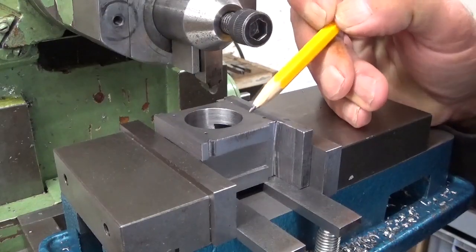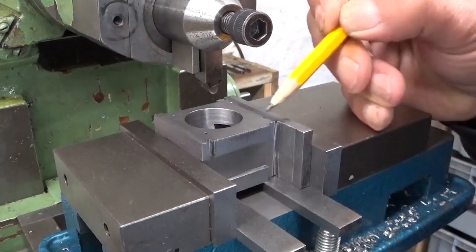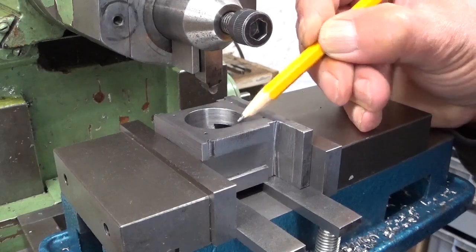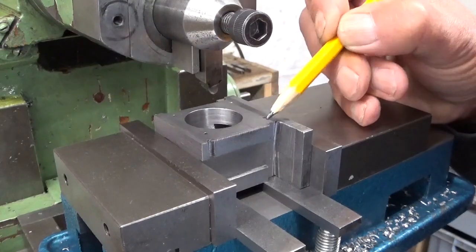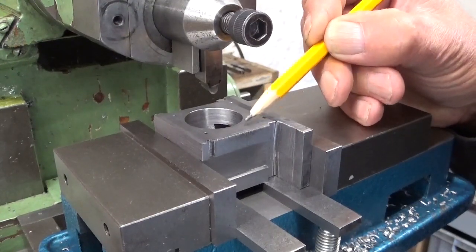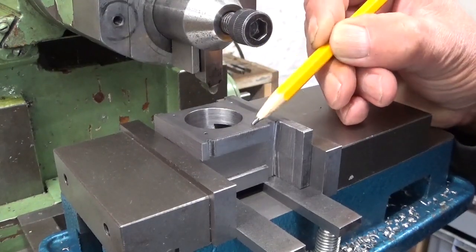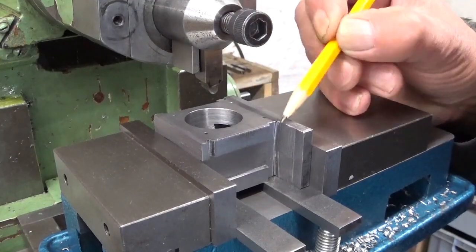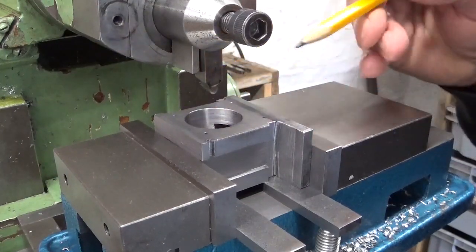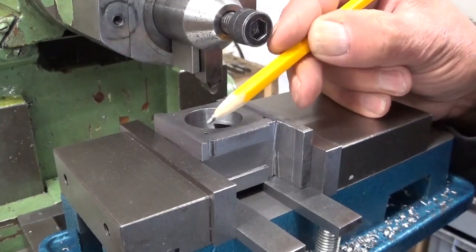Now it is gonna be a little bit of a challenge, because here you see the rail I'm talking about. So this surface now must go down 2.5 mm to have the top side of the rail, and then the rest of this surface that leaves 1.5 deeper than this rail. So I'm gonna cut a groove here at full depth, a groove here, and then I have to make a groove in this direction. But first let's talk stickers.